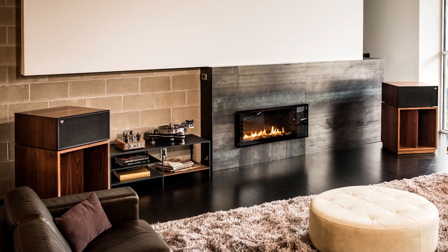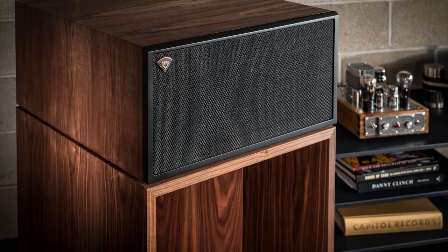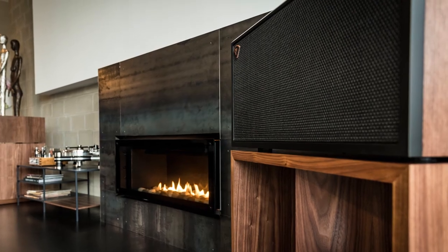In December 2005, the La Scala 2 debuted — the La Scala they started first building in MDF instead of plywood, with a new split HF/LF cabinet shape. Then they went to the 70th Anniversary, which is like a La Scala 3. In 2006, they retooled the tweeter, eliminated the L-brackets, and made the horn stick through the cabinet. In 2016 they came out with the La Scala 2 70th Anniversary.